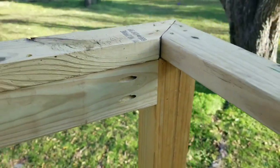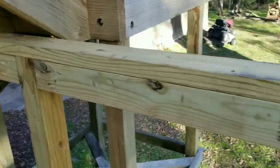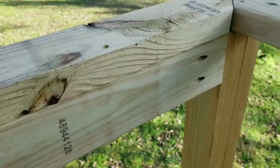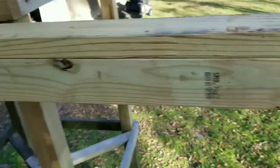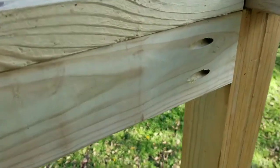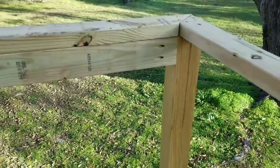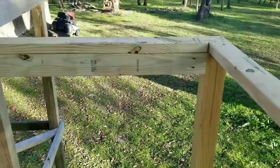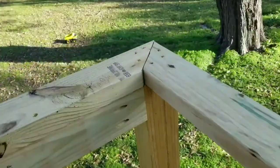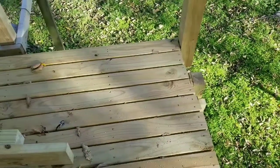The project I'm working on today is a deck, and I'm putting on an upper railing part before I put the verticals down. I'm using a Kreg jig to tie in these end pieces. I thought it'd be really cool to show a quick tutorial on how to get perfectly sunken screw heads, so when you finish your deck from the interior you have this nice recessed screw look. You can see I've got my corners mitered to 45s on top of some 4x4s on an elevated platform.